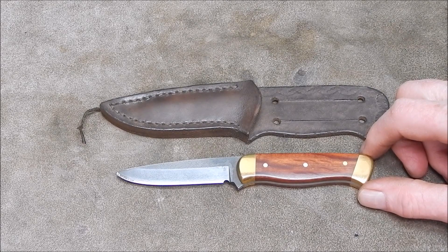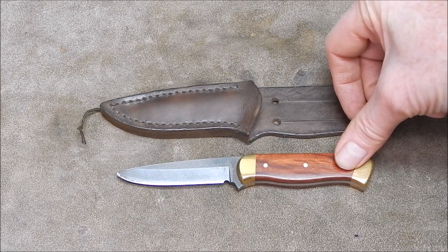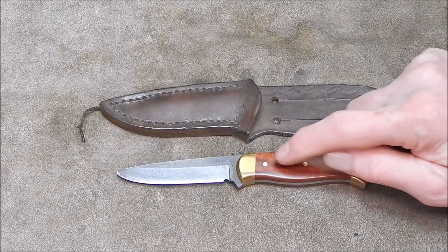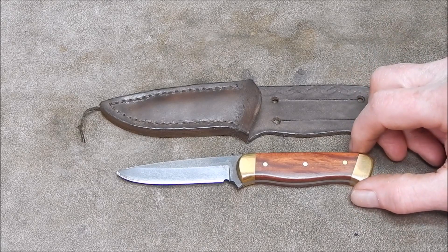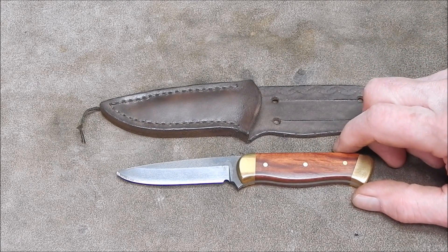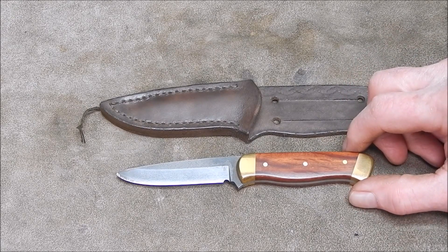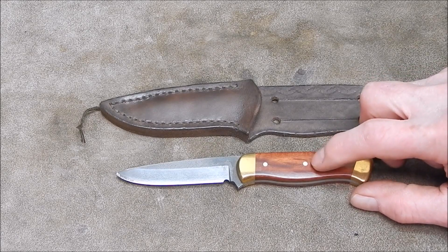Basically you need certain equipment to make knives. I mean, this is one that Bill Baggins in Tasmania made. You've got to be able to grind the blades and the brass and shape the wood and all this. You also have to be able to pin the handles with brass or bronze or whatever metal pins, so you have to be able to turn down small diameters. For that you would use collet chucks to hold the bits, which is what Tony had, and a small lathe, which is what Tony had.